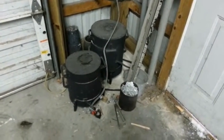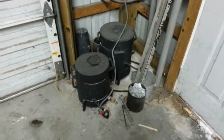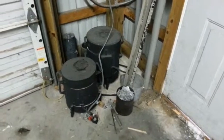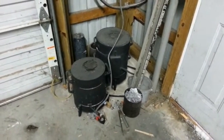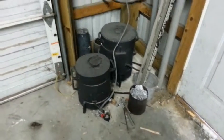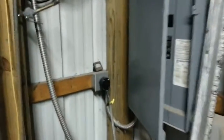I'm going to go over my furnaces. The one on the right toward the back has coiled heating elements like a ceramic kiln — it takes a crucible. The one to the front left is just using a stove burner, with the refractory packed all around it. There's my 220 plug; it's a 20-amp circuit on a 20-amp breaker in the panel.